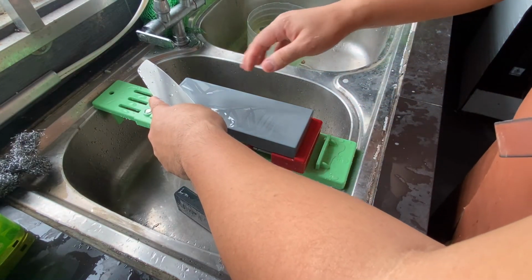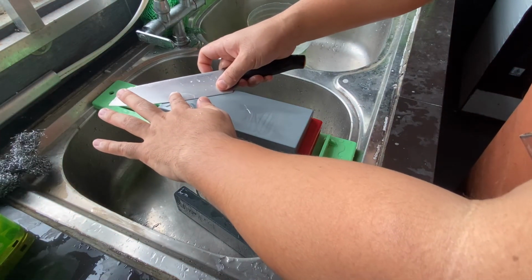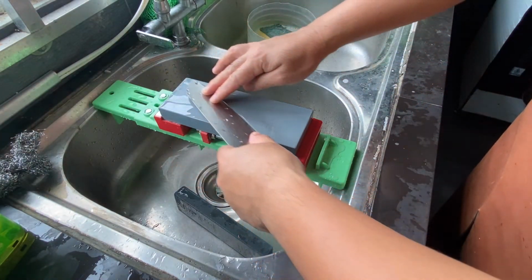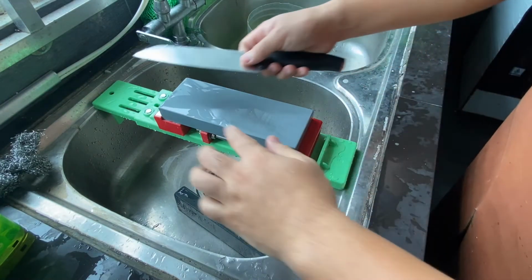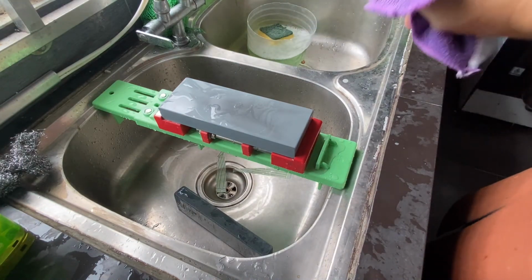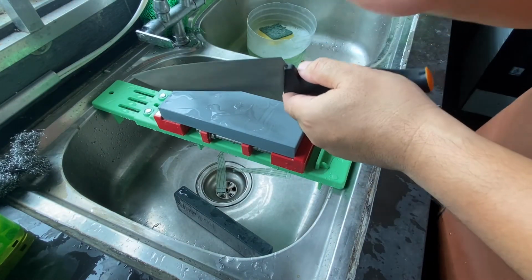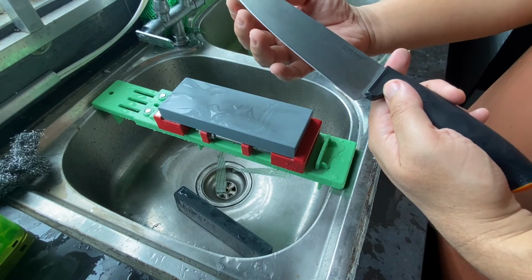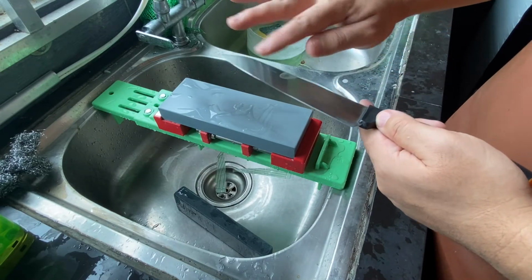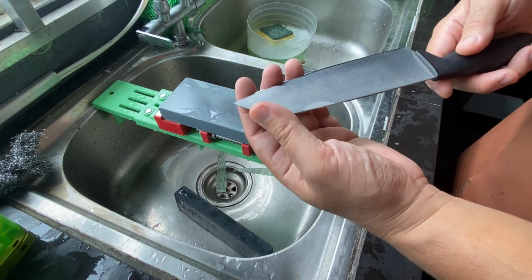Sharpening is easy, deburring is not. If you are not careful, you will end up with a dull knife. That's the deburring process that you need to make sure the longevity of your knife will stay sharp, because the burr is like an imposter. When you are fully apexing and you do your minimization pass, the burr stays straight, it acts like a false edge. But when you cut, when the burr is stripped off from the apex, it will leave you with a dull surface. So you need to get it clean before you find your edge.